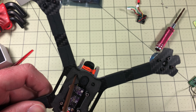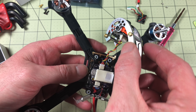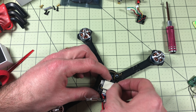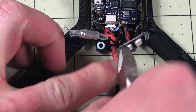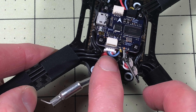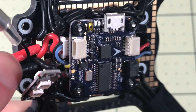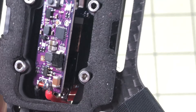There are four screws that hold this top plate on. I'm just going to take those out and take this whole top plate off and get it out of the way. Now we can unplug the camera and get that totally out of the way. I did two layers of double-stick tape to hold the receiver on. These are holding the battery leads in — they use really good zip ties. King Kong or LDARC loves their zip ties. So here this bottom port is going to the buzzer and also going to the board. On their receiver they have it powered from a connection up here to the leads so it's got battery voltage going to it. The ground and the video are not going up so we'll have to figure that out.